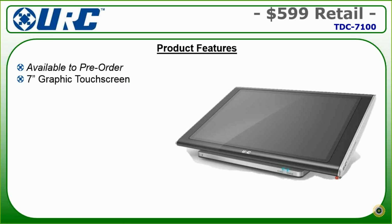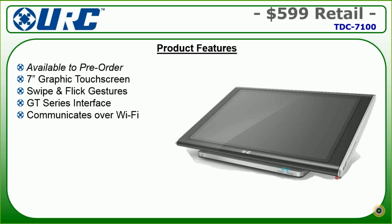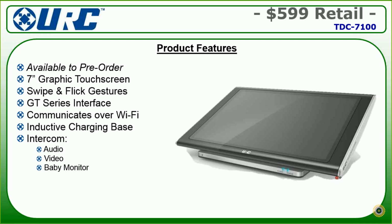So this is, again, a 7-inch graphical touchscreen, still with swipe and flick gestures and our GT interface. But the difference is this communicates via Wi-Fi, so this is a wireless piece. It does have an inductive charging base, and it uses a USB-C, so it's interchangeable. We have that on both the touch panel and the charging base as well. So it's great for a desktop install, maybe a conference room, kitchen, or master bedroom. And this will have full intercomming features as well: a camera in this, as well as a microphone, that will allow you to do audio, video, and baby monitoring as well.